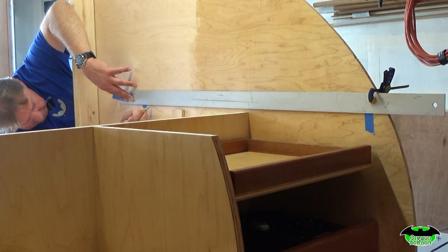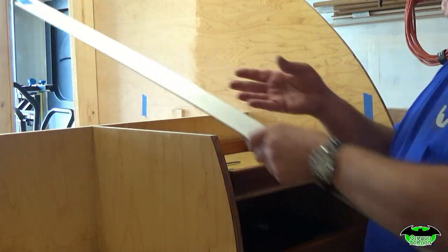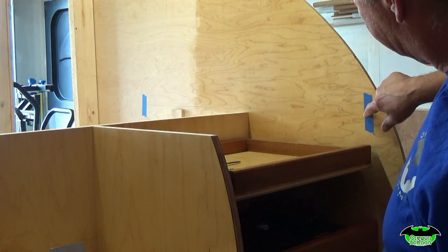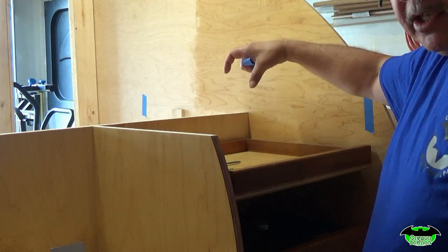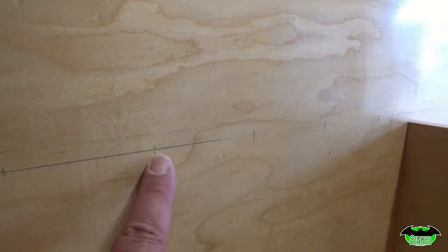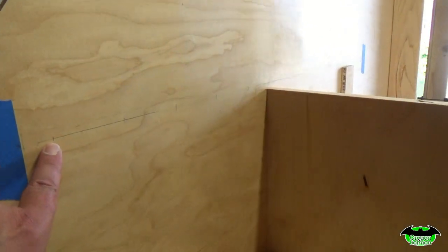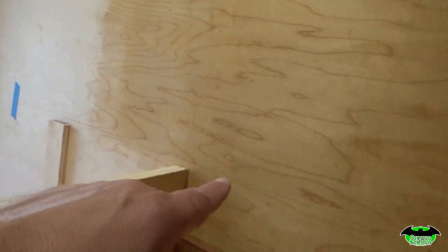Make one little mark on the other side. Now we've got a mark for our center line. From the end of our plywood, I'm going to measure back an inch on both ends, pre-drill those holes, and then my spacing is going to be about three inches in between. Both sides are ticked off — and I don't mean they're mad. So let's get those pre-drilled.